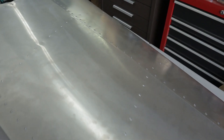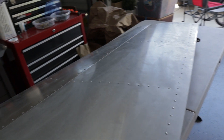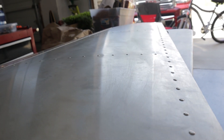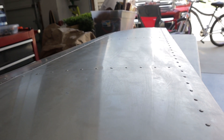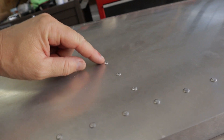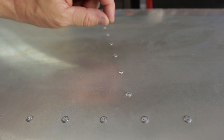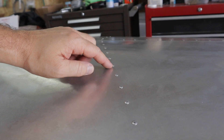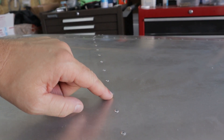Overall I think the vertical turned out well. One thing I do notice is the skin kind of dimples in ever so slightly on some of the holes. I found that if you try to keep the rib flanges as high as the highest part — if you have to flute, like when you get to the wing ribs you'll have to flute those — you don't get rid of these dimples all the way, but you can minimize it. It's just part of having an aluminum aircraft.